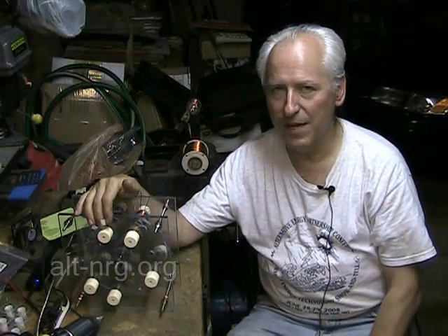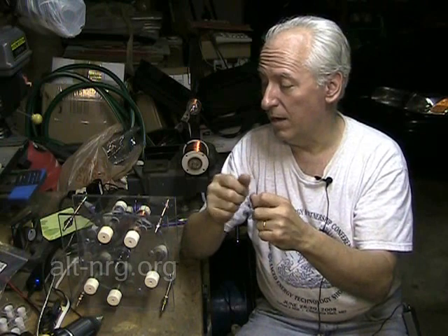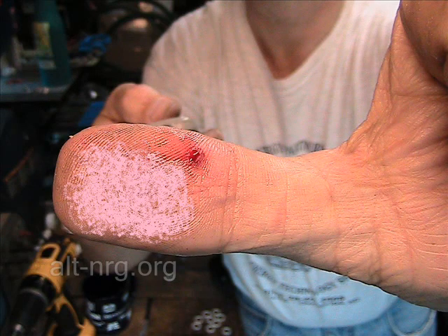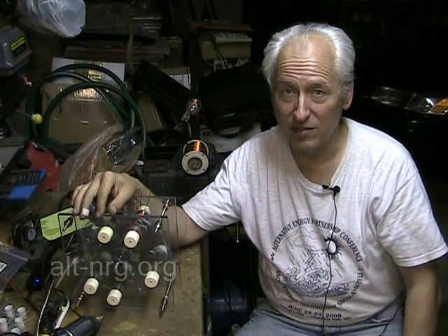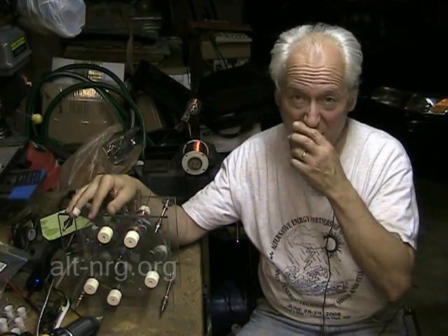When I was assembling these magnets to the back of the stator poles, I was just taking magnets and separating them from the stack as they shipped. They ship with little plastic washers in between to keep them from coming all the way together, because once they are all the way together, they're very difficult to get apart. As I was doing this, one of the plastic washers popped out and two of the magnets came all the way together with a piece of my thumb and a piece of my middle finger in between — where the meat is nice and soft. So if you're a little squeamish, don't look at this next picture, but this is what happens when you allow two neodymium magnets to come together and you're holding them improperly. Please be advised, neodymium magnets are very strong. These are only three-quarters of an inch outside diameter and three-eighths of an inch thickness — roughly 10 millimeters by 20 millimeters for those on metric. Not big magnets. Still very strong, still deserve a lot of respect. Please be careful when dealing with neodymium magnets.